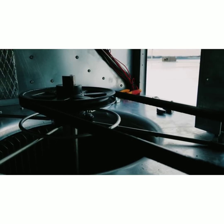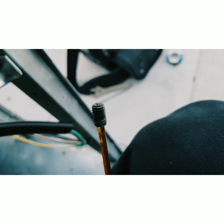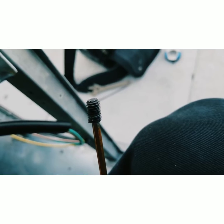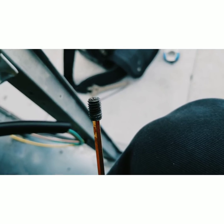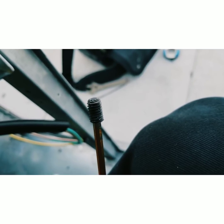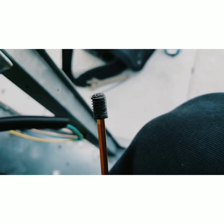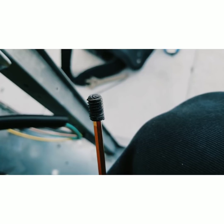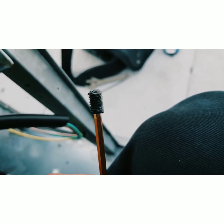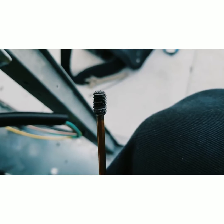You can see the allen screw has a bit of a rough bottom edge. What we're going to do is screw that into the key — the key sits in the keyway of the shaft and the pulley — and basically we're going to screw the allen screw right into that key. We're going to tighten it, leave a groove, retract it, then tighten it again and repeat until we've left a groove big enough for the screw to sit in. It's a good practice to get these things to stay in place.